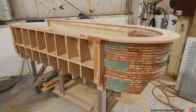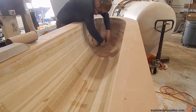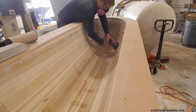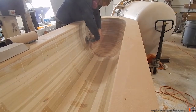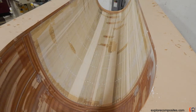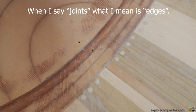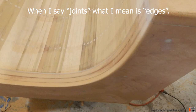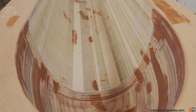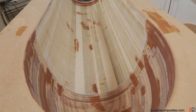Now some fairing — I'm going to get in there with a grinder and knock down any lumps. It's a pretty nasty job but it didn't take too long and ended up pretty nice, just making sure that joint is as good as it can be before it gets glassed. I went around and did some more filling with red micro balloons and put a little radius on all the joints — sanding, fairing, filling all the holes, and getting it ready for fiberglass. This is the finished bit: all joints radiused so the glass will go over nicely. Next step is putting six-ounce fiberglass over the whole thing to give it vacuum integrity.